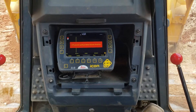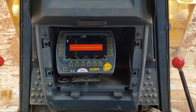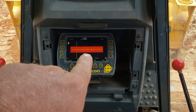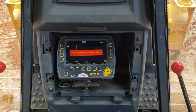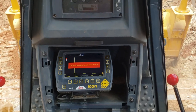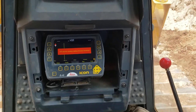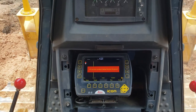If it doesn't come up really quick, or if it says this note right here — 'GPS solution quality is below solution threshold' — right now we're in a hole on a vault that we're doing. What we may have to do is move the machine, and sometimes whenever you start moving the machine it'll grab that signal without having to do much more.